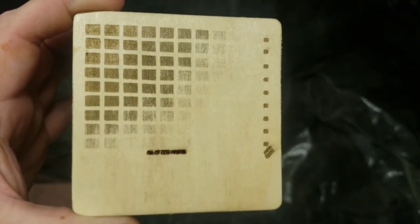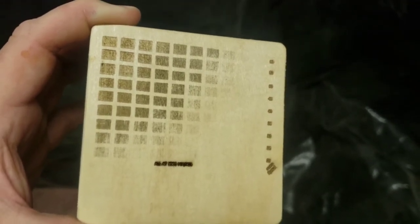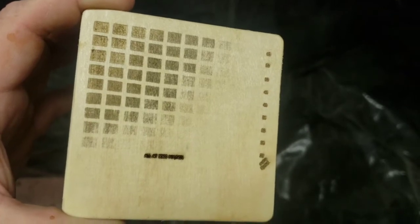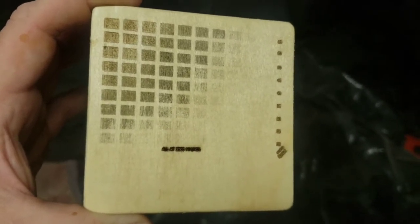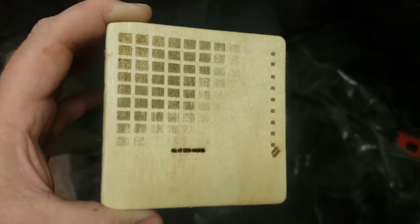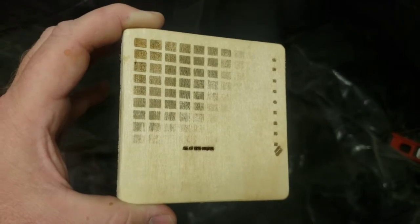Here's the second test board. This one still has one coat of the Kenny Hack put on, except this time all the test swatches were set to run at 3,000 millimeters — kind of the manufacturer-recommended fastest engraving speed. I went with the fourth from the bottom, showing 35%, so that's what I ran my test at. The problem is this is just set with Lightburn's fill — just drawn squares set to fill — and I don't know how that translates into the dithering effects like Jarvis, which is the highest quality one.